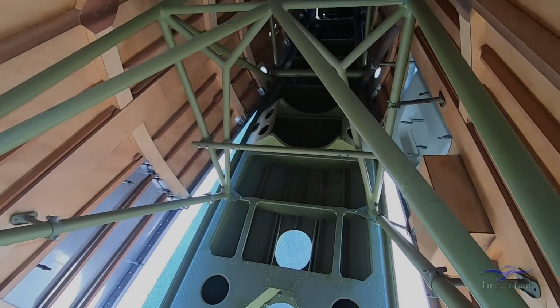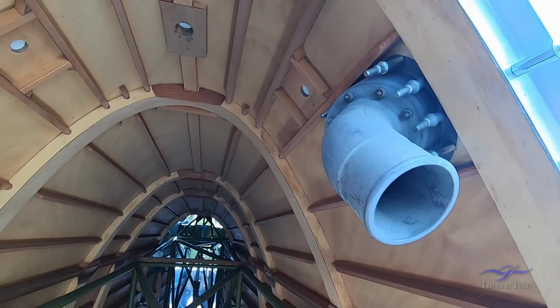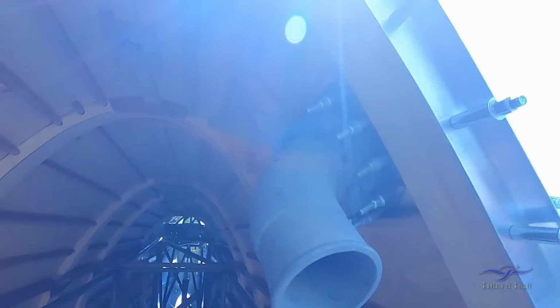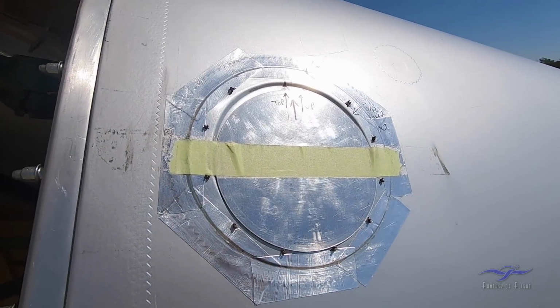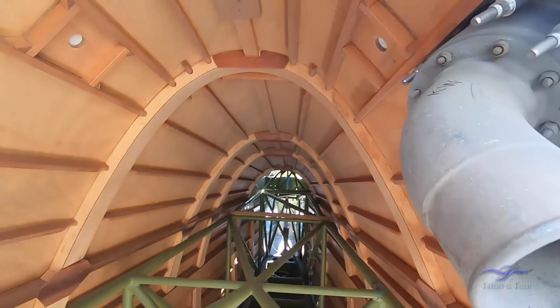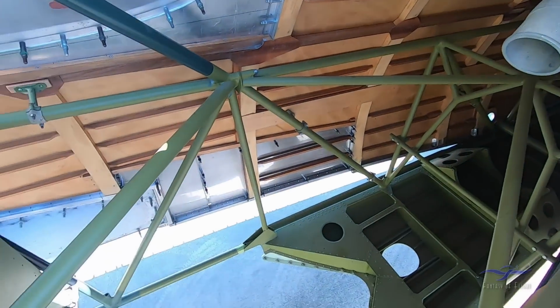As we come back out of this radio hatch area, you can see on the side here the inlet for the fuselage fuel tank. So this casting and internal housing was accessed through this inspection panel on the outside, and the fuel hose could be put down with the nozzle inside through this filler neck, which then went down a rubber hose into the fuselage fuel tank that was located just in this zone here.